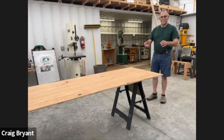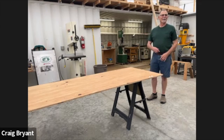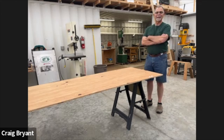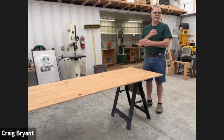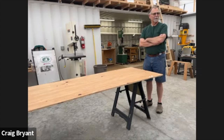The last bonus is, when you get a big square blank and you're making a tapered mast, you don't have to have the glue line right in the middle. You can cut the curves if you want, as long as you have enough wood on both sides. So for many reasons, cutting something down before you scarf it also allows you, if you have 4 scarves, to put them in different spots in the mast so you don't have one spot that looks like a zipper. In truth, I don't think it matters very much because epoxy scarves are so incredibly strong.